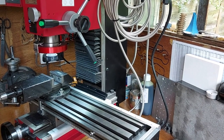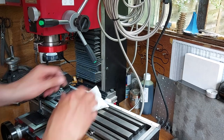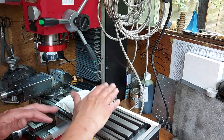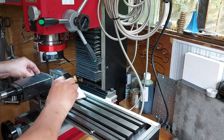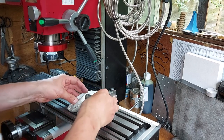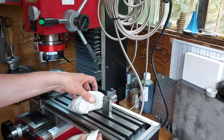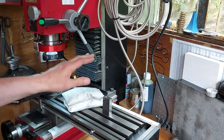The milling machine is now all back up and running. I've also got some additional bags — actually these are cast iron bags, filled with cast iron dust from machining. I've got a couple spare that I'm going to use for damping items on the table. If I'm machining something and it's vibrating a lot, I can add these either side of the vice, or directly on the part, to damp it down. It's a fairly traditional technique in milling machine use to add sandbags as damping. These cast iron ones are a bit heavier, they stay in place nicely, and they're good for general use around the workshop for holding things down.